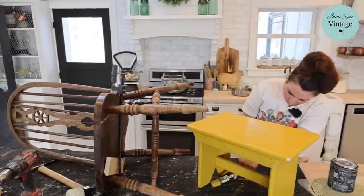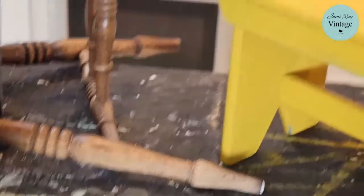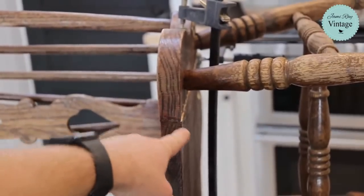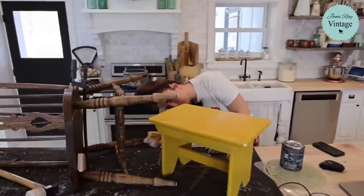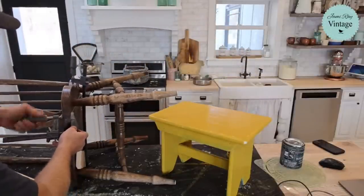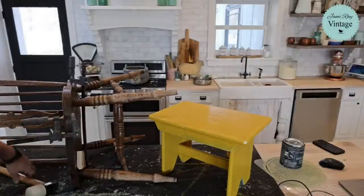Let me see if I can zoom in right here so you can actually see what I'm trying to accomplish. So right here, this is split and it's really high — it's got a little ridge. So the wide clamp closed the gap, but now I've got to fix that ridge. I'm just clamping that down with the other clamp. Sometimes you need multiple clamps — you can never have too many clamps.